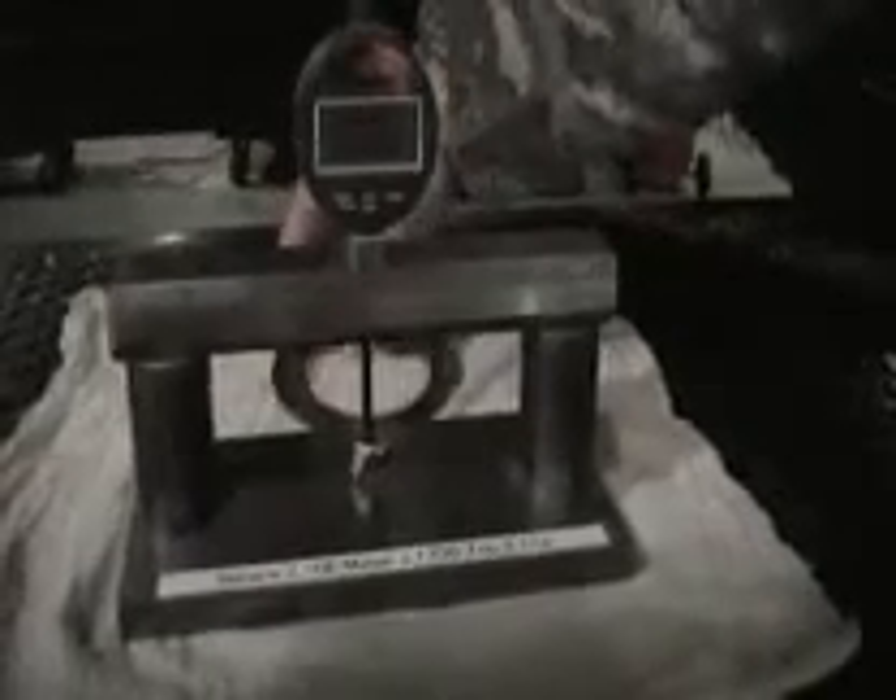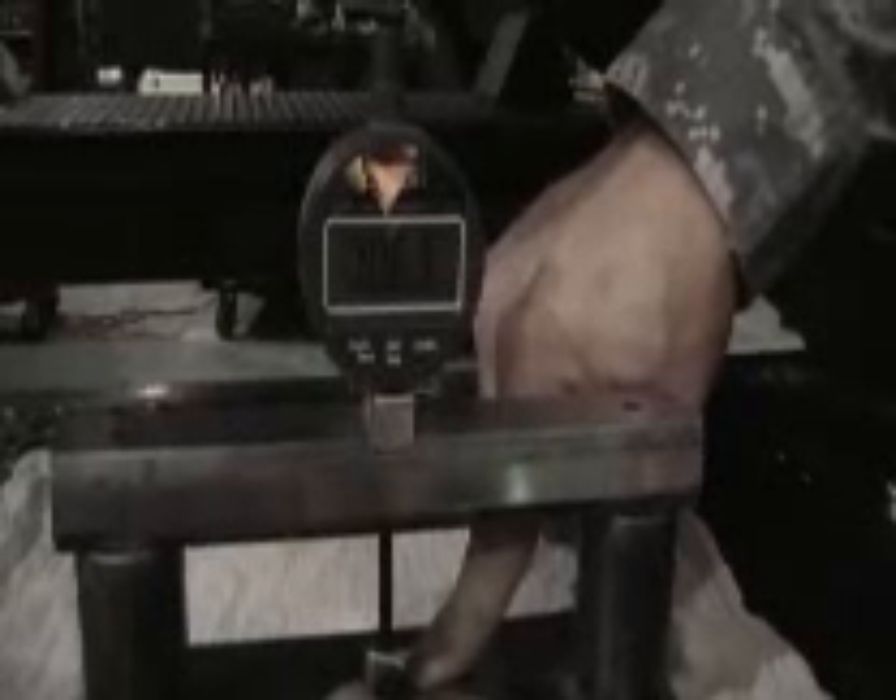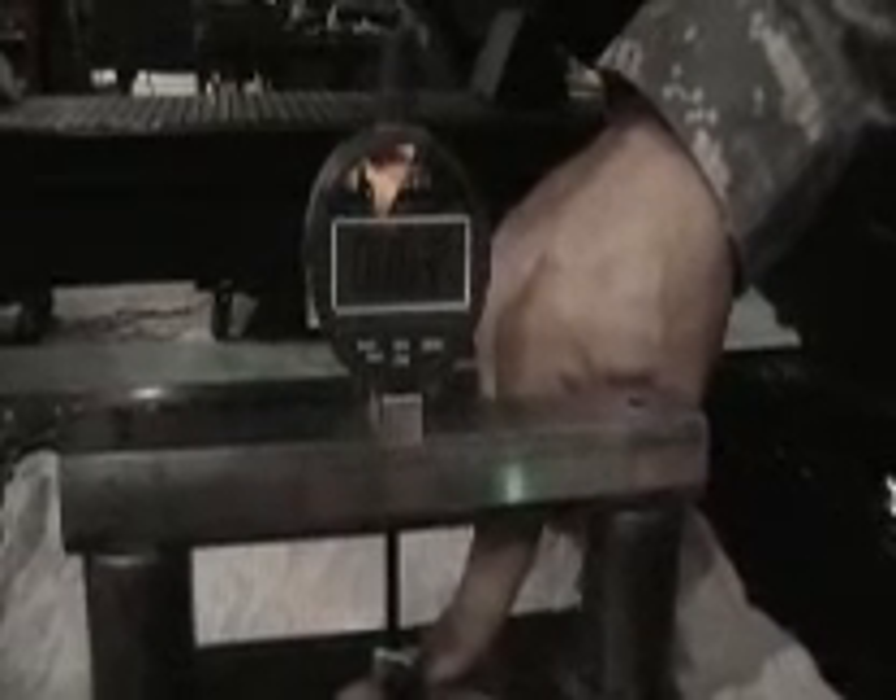Record the measurement off your gauge. At this point you return back to the rest, place the tool back onto the rest, assemble your shim pack, and raise the dial indicator — ensuring to hold down that your shims are tight against the base. If you're not sure, do the shims one at a time or use a zero to one mic and mic each shim.